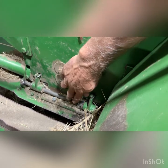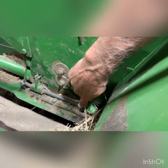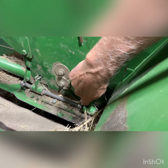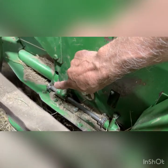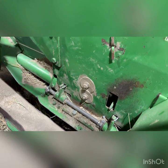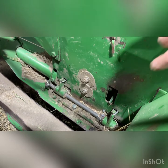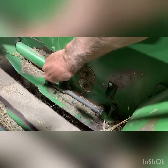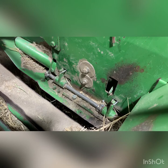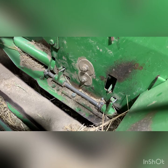What I've done is spot-welded these bigger collars on here — not just the bushing but a big collar — so this is all solid now. I took the movement out of this shaft and the movement now pivots right here where it's supposed to. This will never wear out again. When you weld here you just need a couple of spot welds — you don't have to make it pretty. There's hardly any room to move down in here when doing these welds. Just make sure it's solid. My background is in the aviation industry, so I like things to be fairly snug.